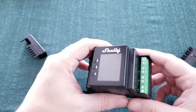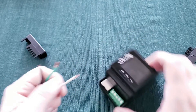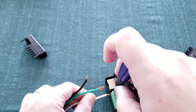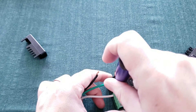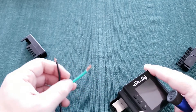And now let's go ahead and get to it. First thing that we'll do here is we will lock down our neutral wire into the neutral wire terminal. Make sure you get this snug, but you don't have to destroy the device. Move this ground wire out of the way.